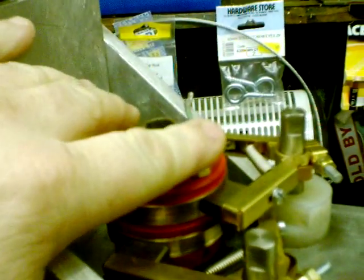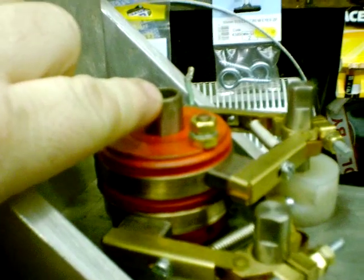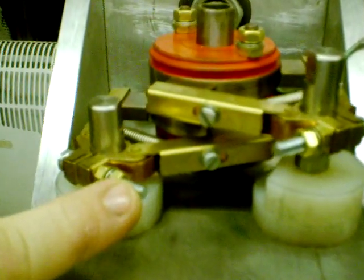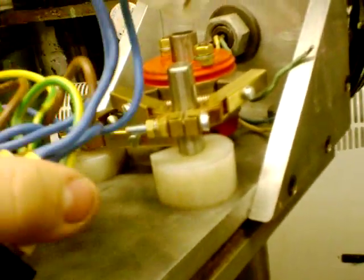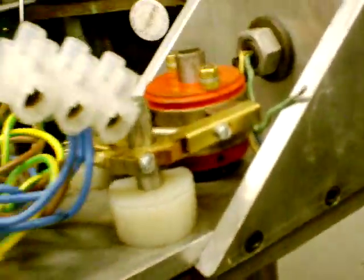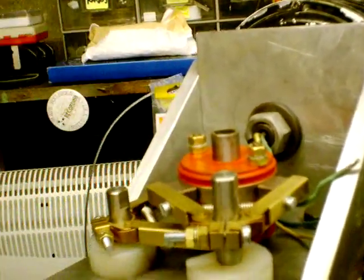The two cores come off these bolts here and the power comes through the centre, up the cable, up the pole. At the top it touches those two there — the brushes convey the actual 12 volts to these points on here. There's enough clearance between the two of them so there's no problem. The other bit I need on this generator is a rectifier kit, which is this — which I used on my old one. That's got to be fitted to the back, the wires have got to be nice and tidy, and I'll just run the three wires to the connector. The other end has two wires and they attach to the actual brushes, so you can put the juice down the centre of the slip ring.